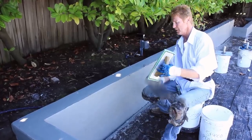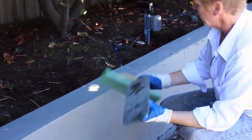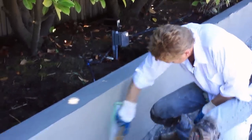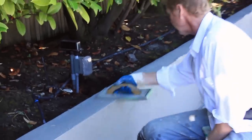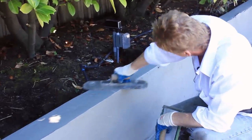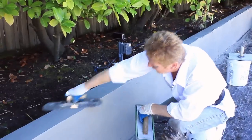Once this is set, I'll show you how we continue to hard steel trowel it — this is just one stage of the job. We've got this whole thing spread out and now it's just a matter of going back over it and steel troweling the tops. If it kind of gets away from you, you can hit it with water for just a short while. I'll hit this section with a sponge float. There are many different tools to wet it down — you bring it back to life and then hit it again. Keep in mind I'm using only the middle part of my trowel, not the edges.